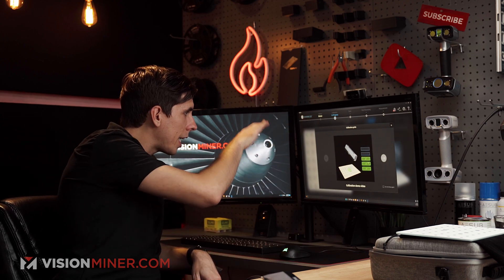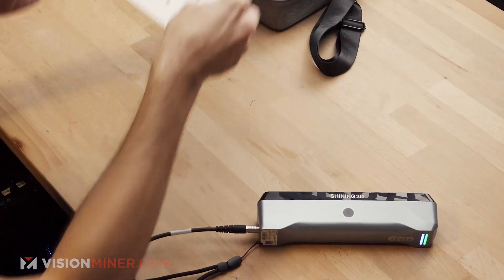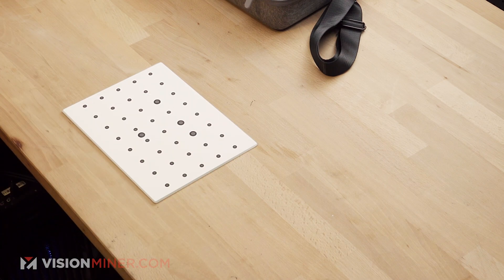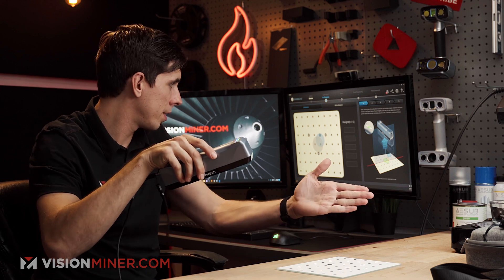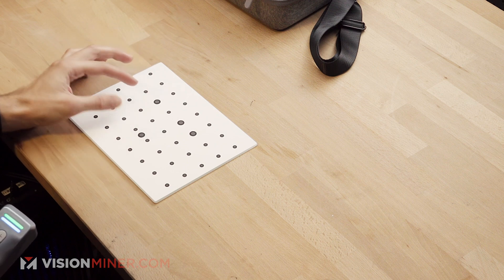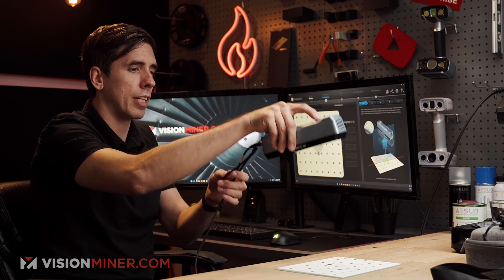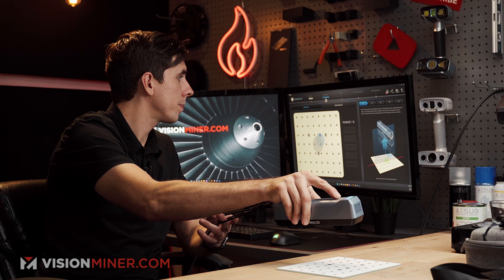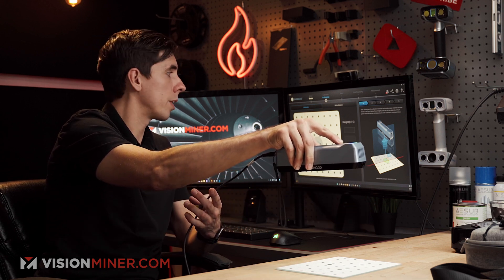Calibration guide — we're going to do a couple different angles. I'm going to take the board and put it flat on the table here. I take the scanner, press the button, start it low. It shows me the dots — I need it oriented correctly. Three big dots on top, one big dot on the bottom, and the scanner oriented like this. I go ahead and hit the start button. It's too close, it's telling me, so I gradually move up.